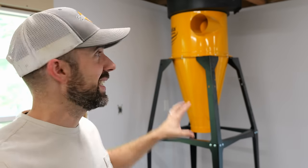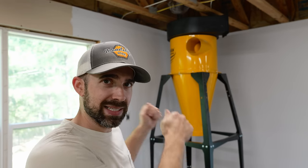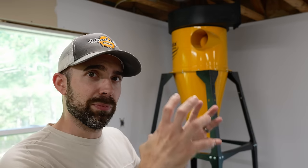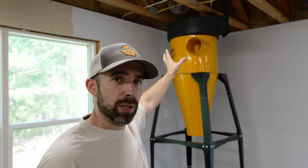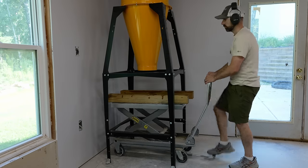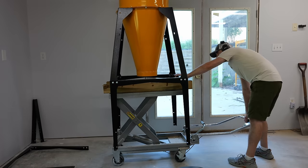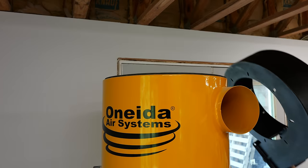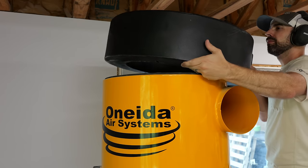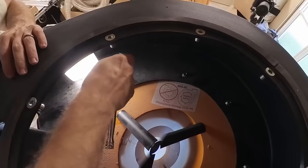Things were going to be tight space-wise. I can lift the motor up into place on top of the dust collector but the problem is getting the impeller down inside of that upper piece. I'm going to modify the base so I can lower the entire assembly. With the leg extensions back off the stand, I can easily attach the fan housing and I'll have just enough clearance above the unit to set the motor assembly in place.